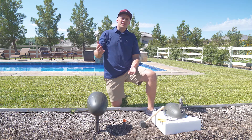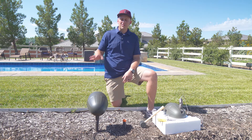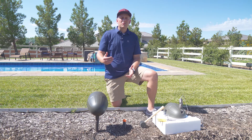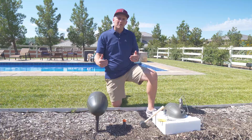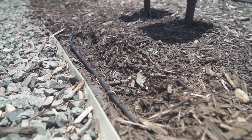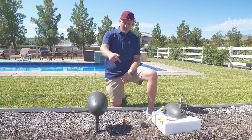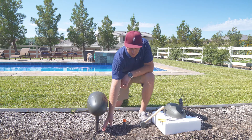Because we're dealing with a mature backyard with a pool already in place as well as irrigation lines, the homeowner wanted us to minimize any trenching in the garden area. So we brought back the gravel and bark in the appropriate areas, used landscape stakes to stake our 14-gauge two-conductor wire down, and brought in a service loop to each speaker location.